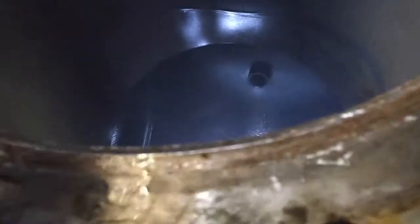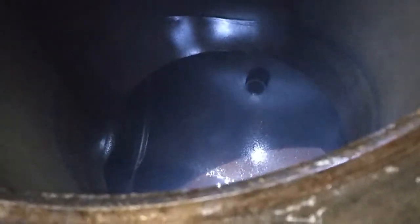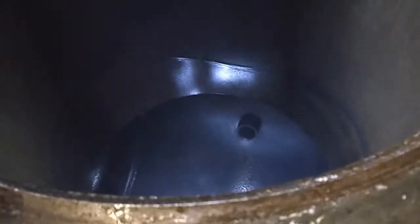That rust can break off and cause damage to the internal components. If it's too hot, it degrades the oil. Above 180 degrees it starts to break the oil down. 180 is a good number, but you really don't want to see it over 200 degrees.